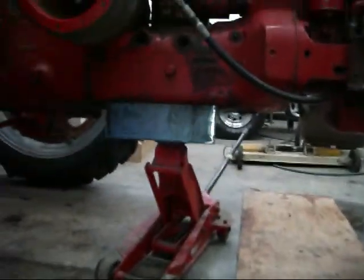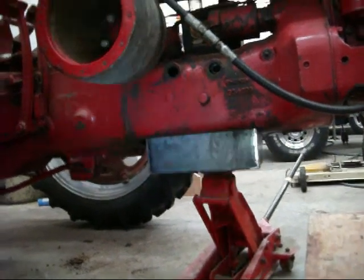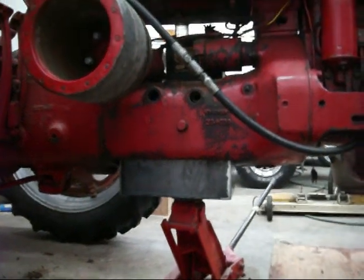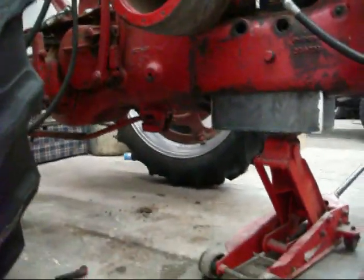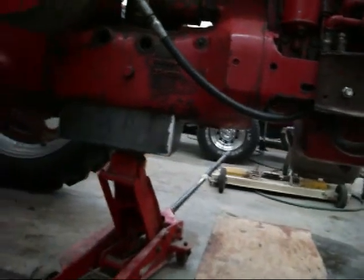I don't think it hangs down too terrible far. The original belly pump goes down 5 1/4 inches, and this thing goes down 5, so it's actually just a hair higher than the lowest dip of the original belly pump, and it's still higher than the drawbar is, and only slightly lower than the engine oil pan.